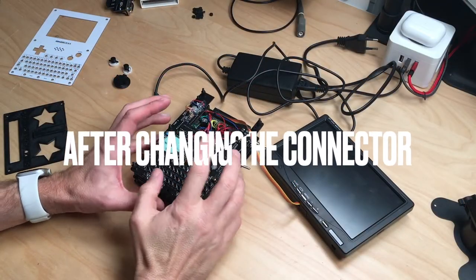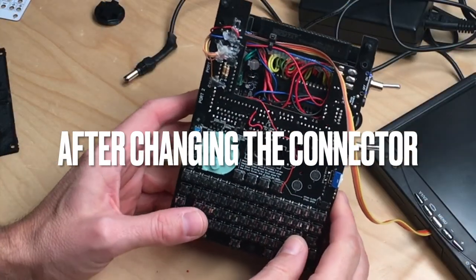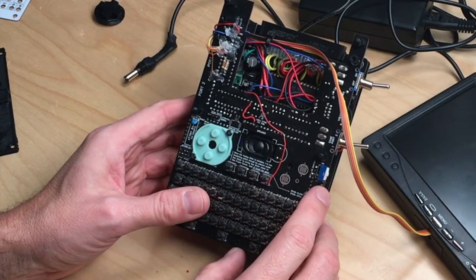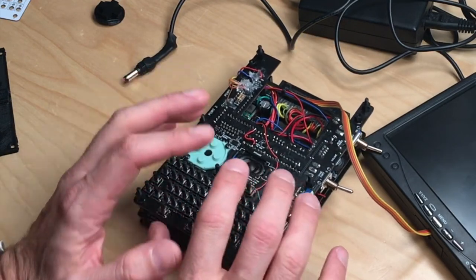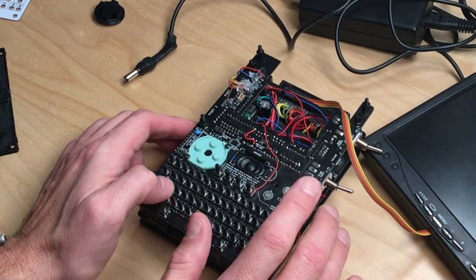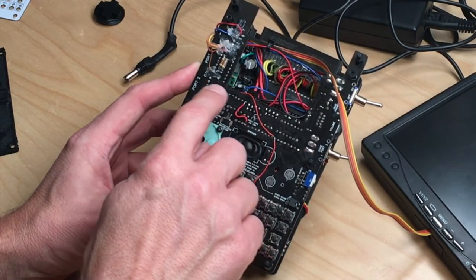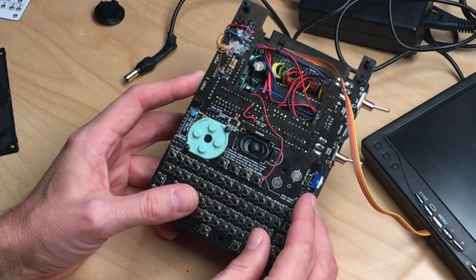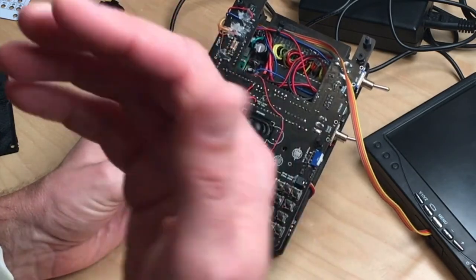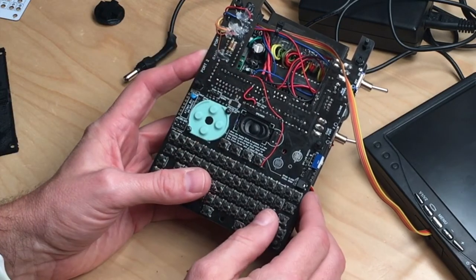So after doing some botch wiring and stuff, and you can see this is not the prettiest job in the world, I finally got it running. And this is not due to the complexity of the project or anything, but just to my pure dumbness, as is so often. I did indeed have a cold solder joint up over here, and I did remove the connectors which keep these two boards together, changed them because I thought these connectors weren't good, did testing all the time.